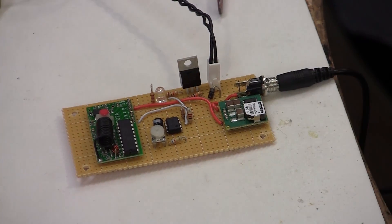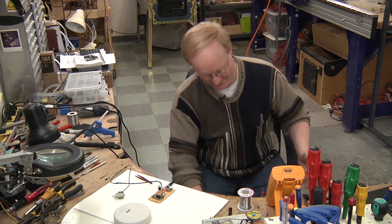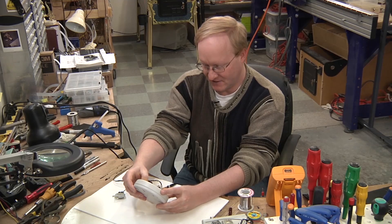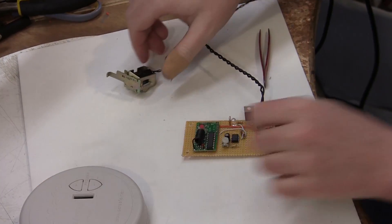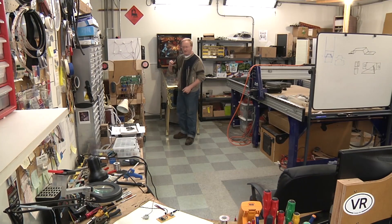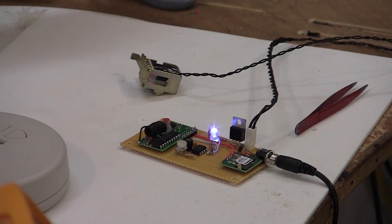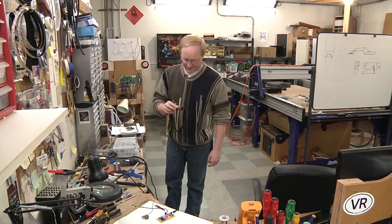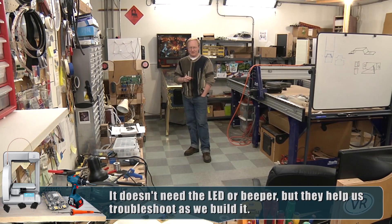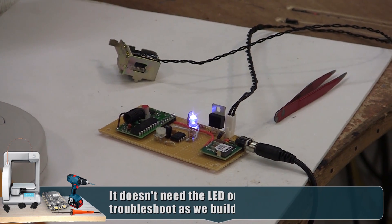I'm going to plug this in and we can just do a short test. There's also a light so in case the solenoid didn't click, the light will also be on. I hooked up the light before the solenoid — one thing at a time. I'm gonna turn on my base station. Let's do a test — okay that represents a dog door. Here is the dog collar — I'm gonna come into range. It's going to let the right one in. I'm continuing to send pulses, so I'm going to get out of range. It's set to about 12 seconds, which will allow the door to come to a complete rest and then close up again.